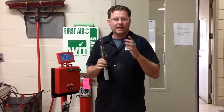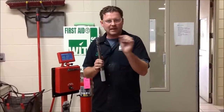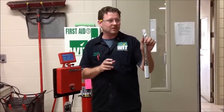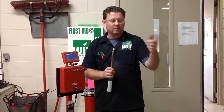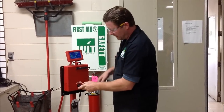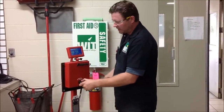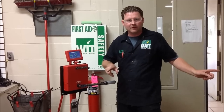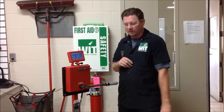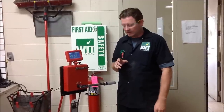What we know today is that wrench is grossly different. Now to finish this off — to do a true ABA test — we tested the Snap-on as our first variable, then we went to something else and got data we didn't like. What we need to do is put the Snap-on back in. I'm an even different operator than Lexi, and I'm getting that same number, so that showed that two different operators can produce the same result. It's a very thorough test. Unfortunately, calibration of the Harbor Freight is still off.